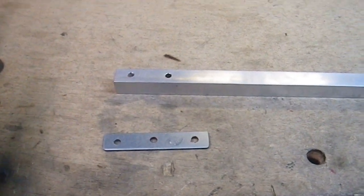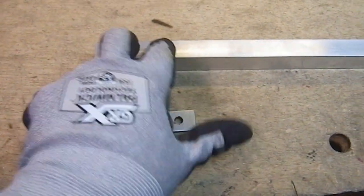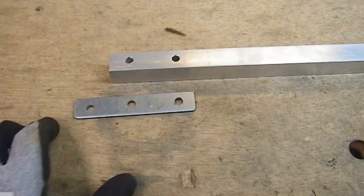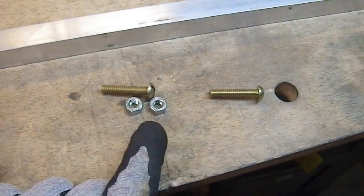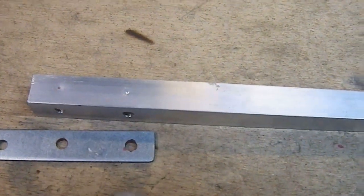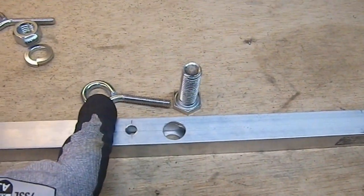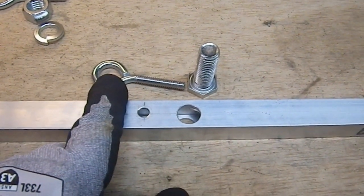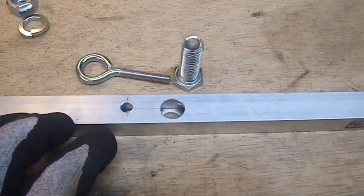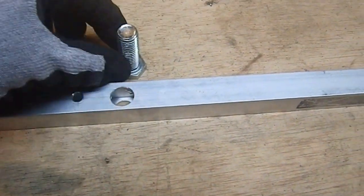I went into the zone and I'm actually finished with all the components. Here is the bracket — these two holes will go into the boom, leaving the end hanging out in space, and that's how I'll attach the camera to the whole fixture. I've got quarter-inch 20 bolts and nuts for that. I almost screwed up but stopped myself. Here is the connection piece for the tripod head and one of the eye bolts. The other eye bolt just by itself works perfectly as a fastener — just screw it right through the tubing and into the shoe itself.